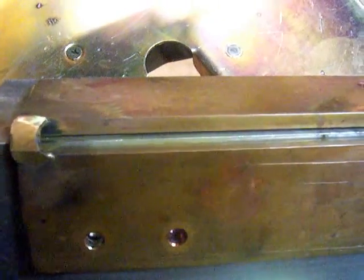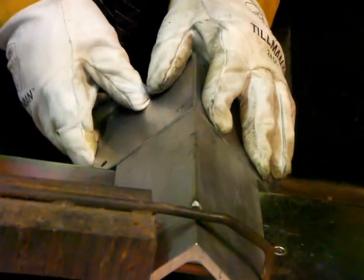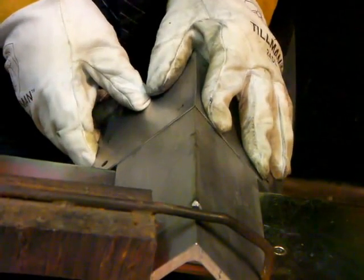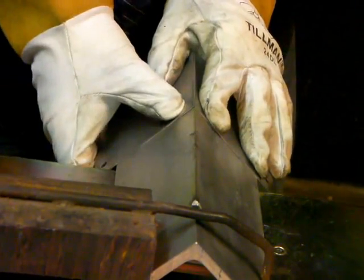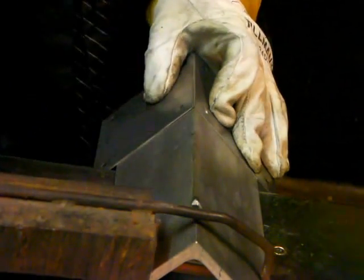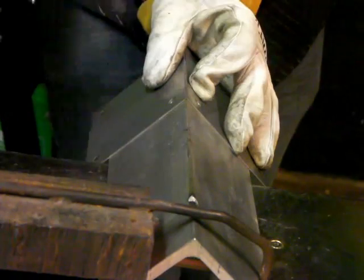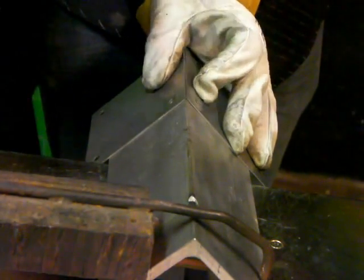I got the two pieces welded up and ground them off — not because they looked good, that's for sure. I just hit them with a little sander and nobody knows. They're going to serve the purpose. I've got a couple of pieces of 300 series stainless sheet metal laying around, 50 to 60 thousandths thick — about 1.2 millimeters for those of you on that system.